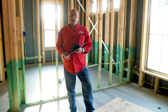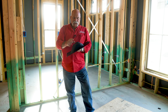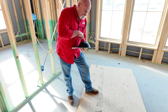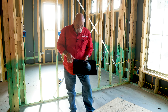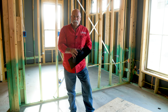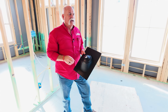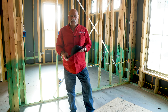Now, these are the flashings for the roof, and you can see that they're angled so that when you lay it down on the tilted roof, the pipe can still go up through here. This will do inch and a half, two inch, and three inch. The plumbers leave these for the roofers — the roofers slide this down over the pipe, then they put the roof in around it. That way, this seals off the pipe where water doesn't come in, and when it rains, you never get water seeping in around the pipe getting into your attic or into your walls or anything like that.